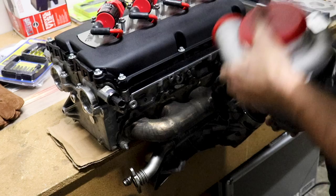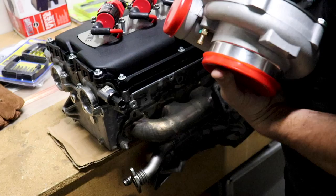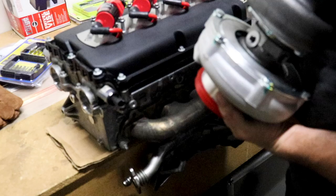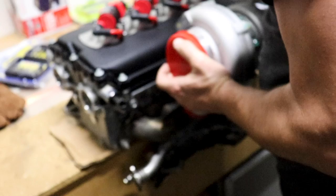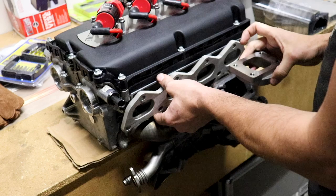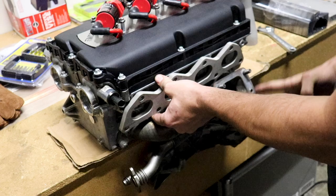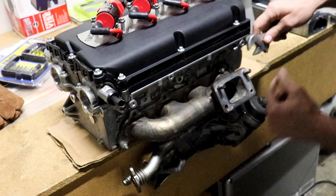I want to push the cool side away, though it still does get a little warm - I just don't want it running or touching the AC lines as much as possible. The new turbo mounts up in pretty much the same location as the other, but we're going to have to clock this thing a little because we need room for this collector. I kind of want the collector itself straight up and down so we can route our individual cylinders to it. It'll probably live somewhere right about here.